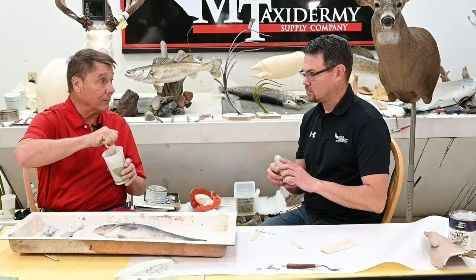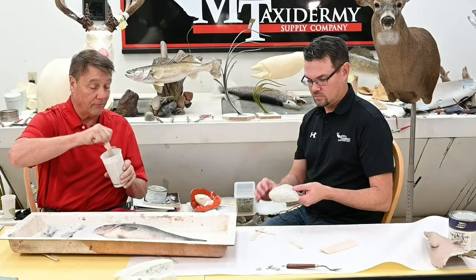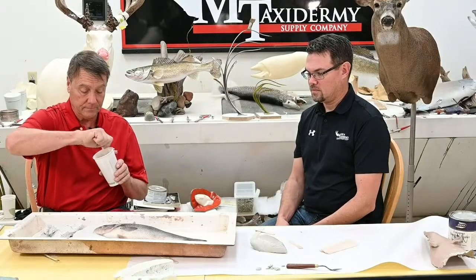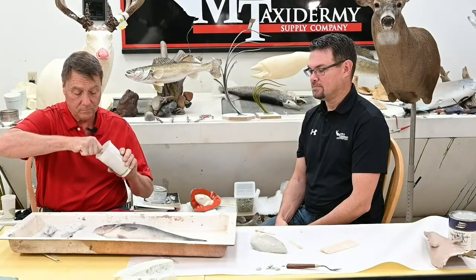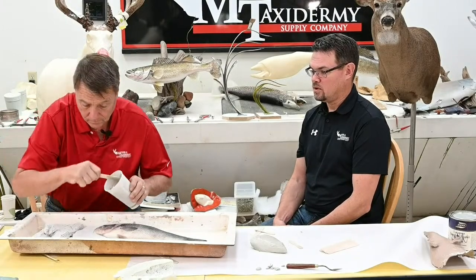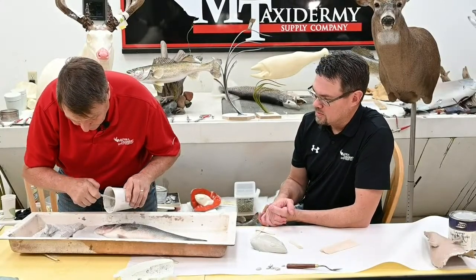There are not as many problems with a closed mouth, because you can't get an interior out of a rigid mold. You'd have to make the mouth a little bit separate. That's something with a lot of undercut, a lot of detail, and might not be as conducive to rigid molds. Although you could make your positive part in a couple pieces, and a lot of people do that too.